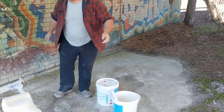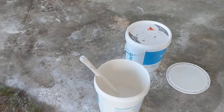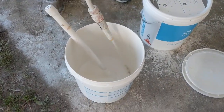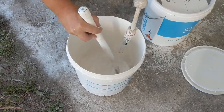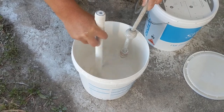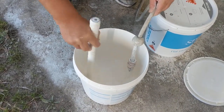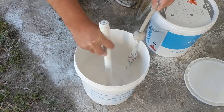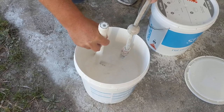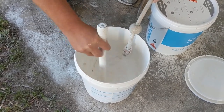I'm going to be adding some water and giving it a very good stir. The paint mixing machines are very susceptible to the paint not being mixed up enough. If it's too thick it will not go through the machine and you'll run into some problems when you're out there actually painting away, and you don't want that. So spend an extra couple of minutes doing this — a really good mix.